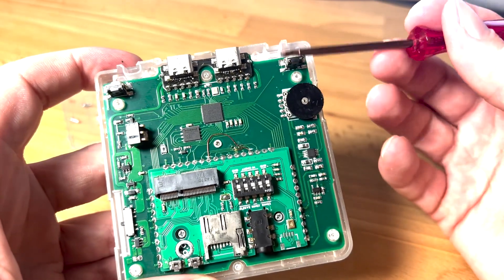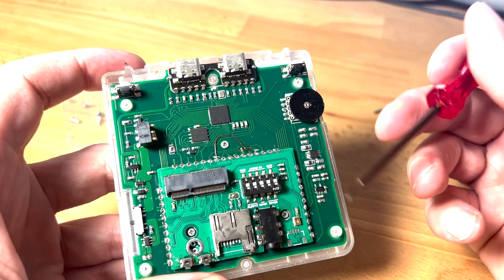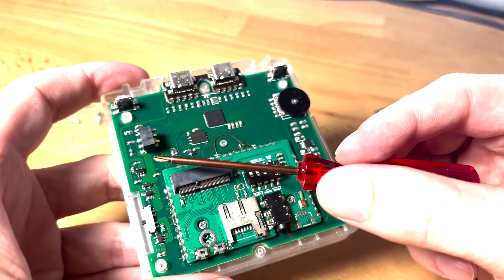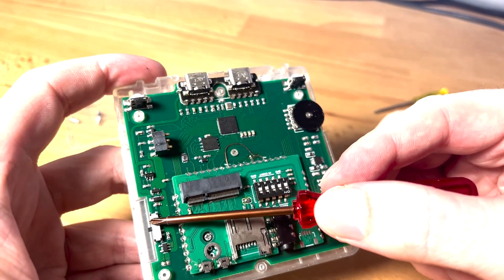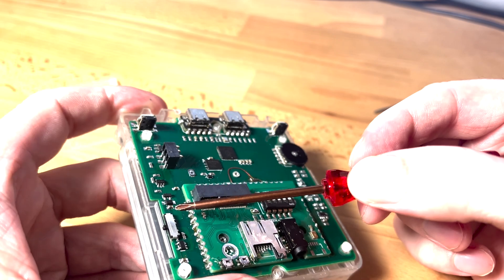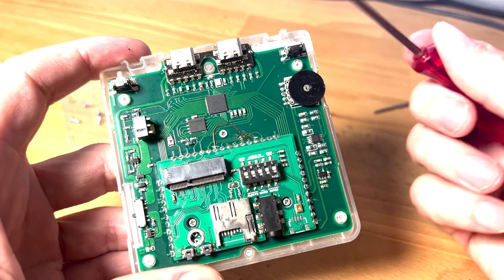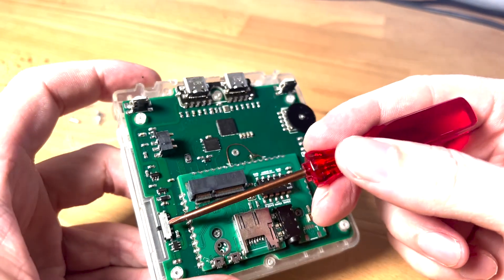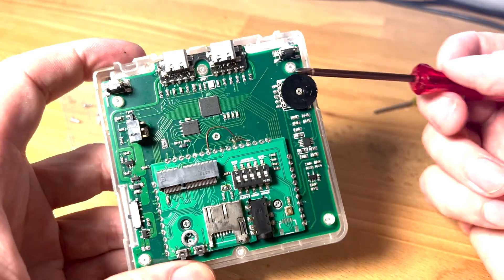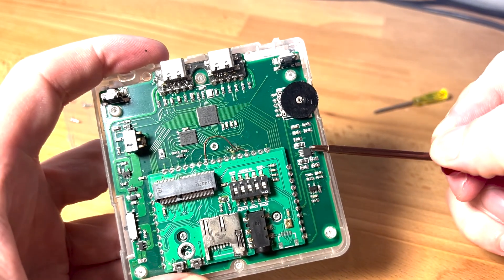Obviously there are the trigger buttons and the volume knob, which probably needs another resistor in parallel or to ground — Ohm's law and stuff like that. There's a power circuit charger. This is a neat little trick: this is an off-the-shelf part, but Nintendo makes it as a custom part. So even when you buy replacement parts to fix broken switches, this is the part you'll get on a little carrier motherboard to fit the original footprint. It's actually a three-position switch but you're only using two of the positions. Same switch from the GBA carried over into the SP.